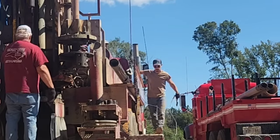Let's see how far our grout's down. So let's see if I can zoom in on that. There's our grout. We put a little bit of chipped bentonite on top of it to soak up the, wow, that's super duper stiff. That's really great. Cool. Now all we gotta do is get our trench here, put our water line and our electric in, and next thing we're gonna work on is putting a pump together.